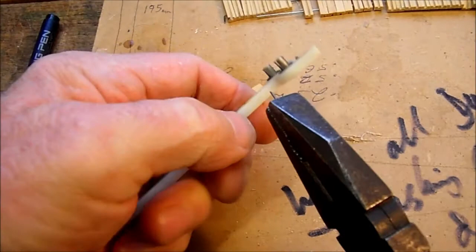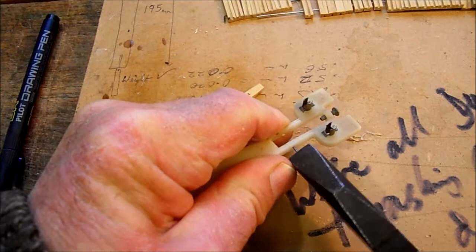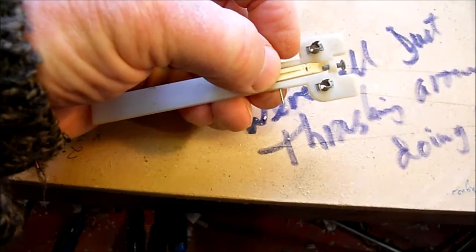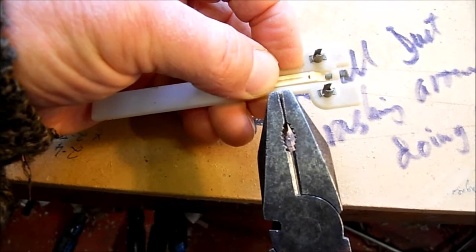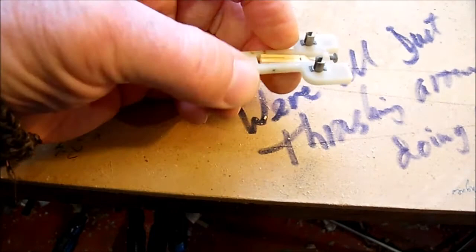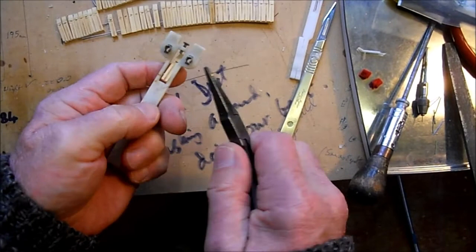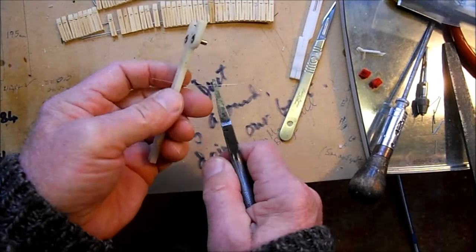Having done that, I'm drilling three further holes and these will accept the spring for the jack. I then need to introduce the axle into the little holes I've made. It's quite a tight fit and it stays there and doesn't slide around. I'll be pushing through the pin so that it fits into the hole in the other side, and I file off any excess pin. The next job can be quite fiddly — I've got a little bronze wire and I'm introducing that from the front of the jack into the lowest of the three holes I made earlier.